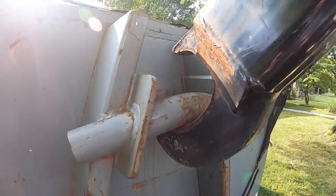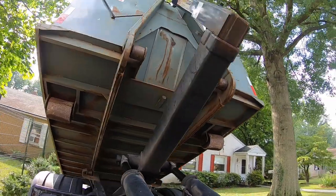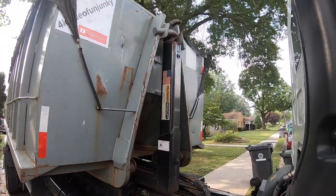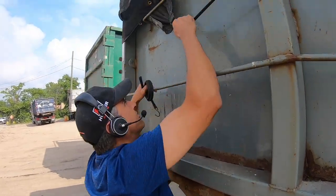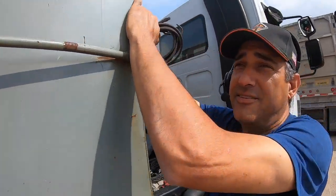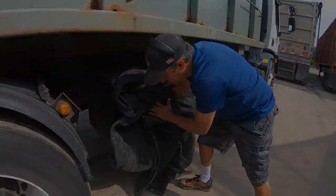I'm going to show you why it's important to open up a full dumpster door. I'm not talking about an empty door when the dumpster is on the ground. What I'm talking about is opening up the dumpster door when it's full, right before you're going to empty it at the dump. A lot of the times the guys will open it for you, but a lot of the times you'll also be opening it yourself. It's critical that you understand how to open up a dumpster door correctly.